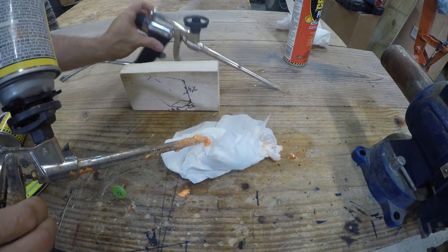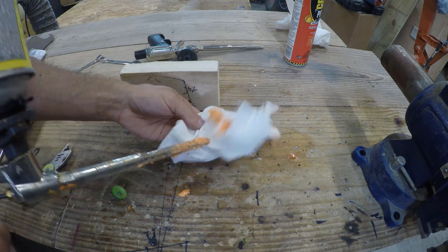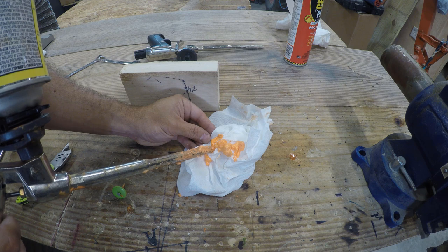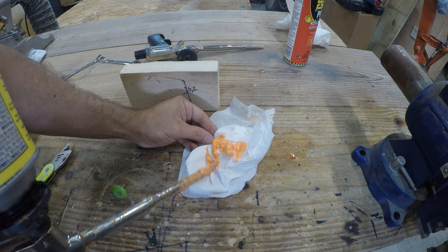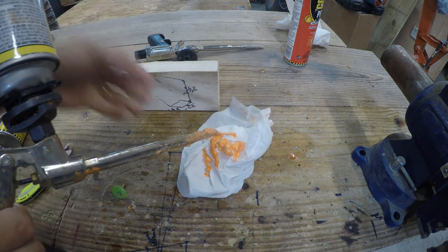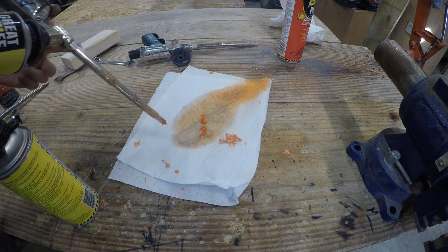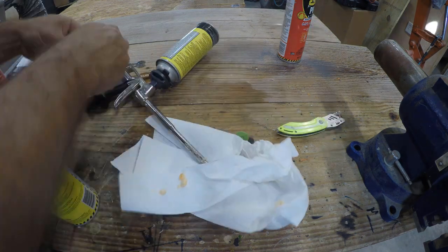Open up the gun again — and nope, still very slow flow. If we are going to open up the pressure chamber, we want to run it until all the pressure is gone. I tied the trigger in the open position with a piece of wire and did something else while it drained out. Eventually the cleaner comes through, but the flow rate is still low, so there must be a partial blockage which renders the gun essentially useless.